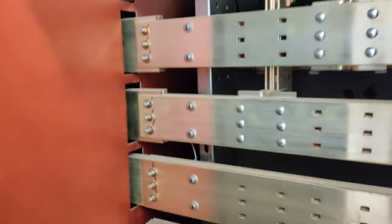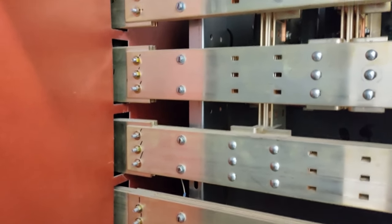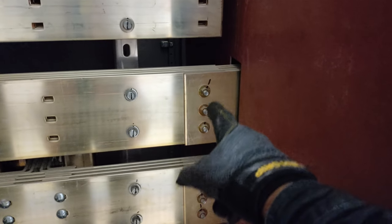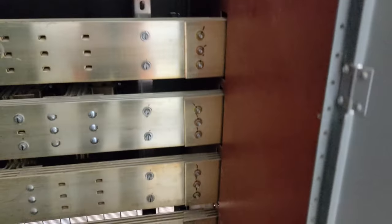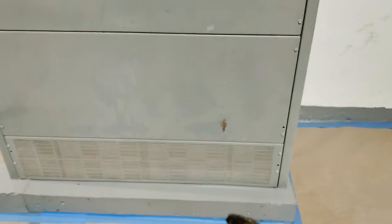This is the inside of the gear. These are the bolts — here's one that holds the two sections together, another one up top, another one on the bottom. This is the inside of the other switch. These are the bus bars. If you have to put this together for some reason, don't forget to torque your bolts — make sure you torque those.